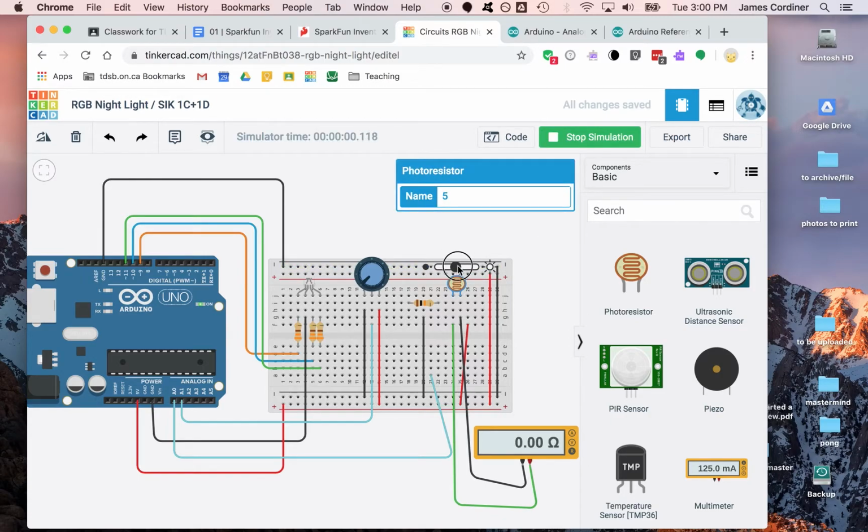So we'll flip the meter to resistance, and we'll run it again. Our setting here was almost no resistance. And that's not a lot of resistance. We're still below 1 kilo ohm. And you can see as it gets brighter, we're edging further and further down. What's the least amount of resistance we can give it? I don't know, half a kilo ohm, 500 ohms. This was still almost 5 volts coming through. Now, relative to this, and there's where the calculation of the voltage divider happens, this 1K value versus this 10K value, that's still pretty small. It's 1/10, and that's pretty small.